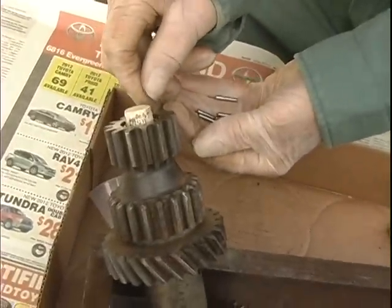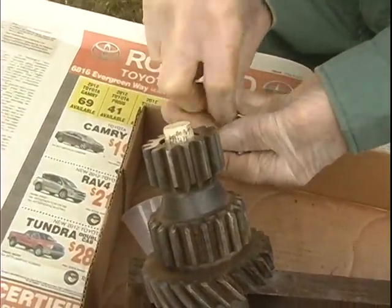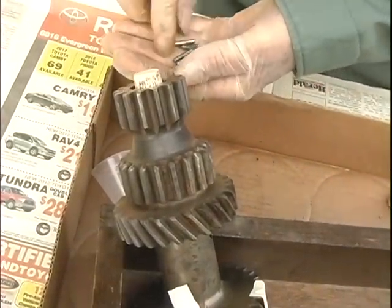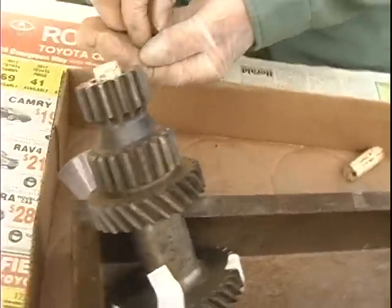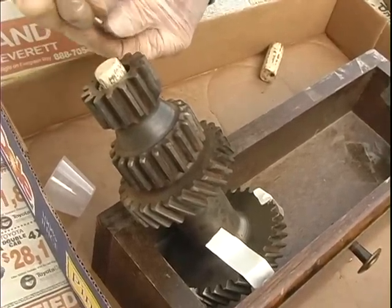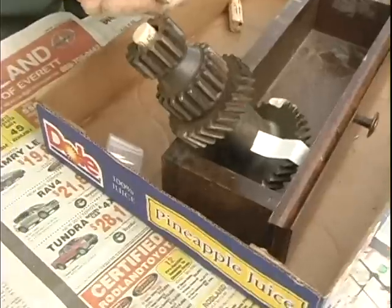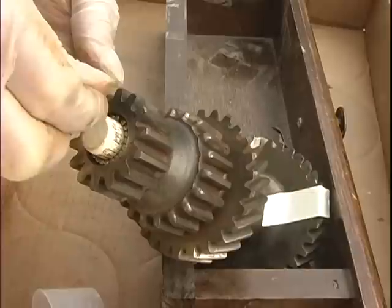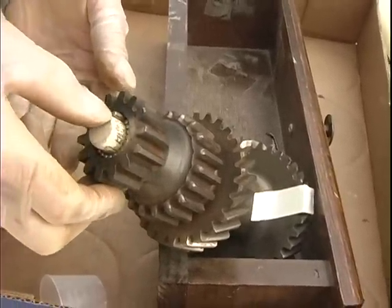Now we've got it turned over. The bottom side is taped down with a piece of cardboard, and we're doing the small side last because it's easier to manhandle. Now we've got the thing full of components, and by having the heavy side down it's just easier to work with. We're loading this side up with the needle bearings. Again it's at an angle — that angle makes all the needle bearings just fall right in place. They don't get twisted up; if it were straight up and down, they have a tendency to fall sideways. And there goes the last one.